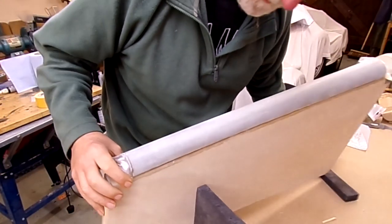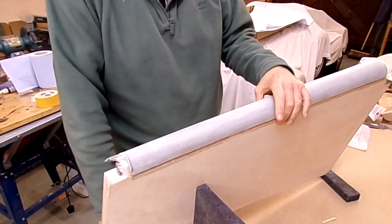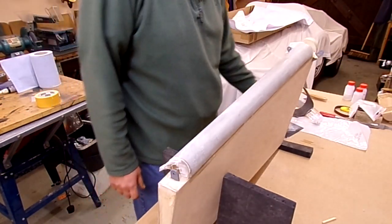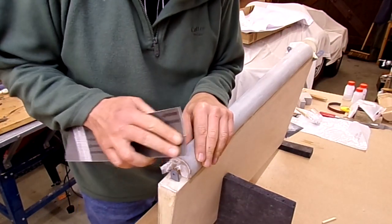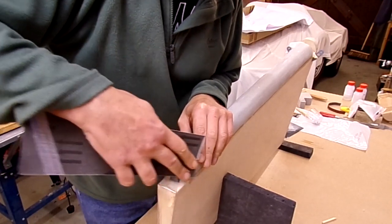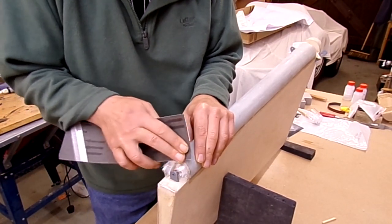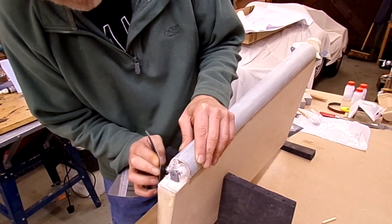Getting back to the rudder, I've trimmed down here along the edge of the fiberglass and the tape line that I had with a sharp scalpel while the fiberglass was still green, partially cured. And now what I'm just going to do is get rid of these edges here, and the way I do that is I just use sandpaper and just run it around the edge there. I don't cut it with a knife or anything like that, I just literally just sand it, and that will get rid of the edge really quite nicely.